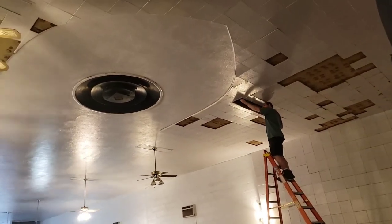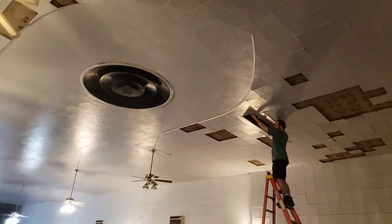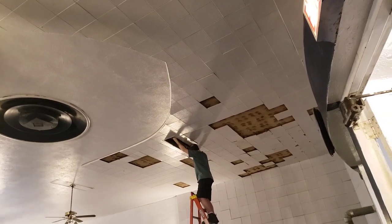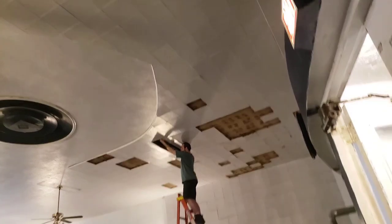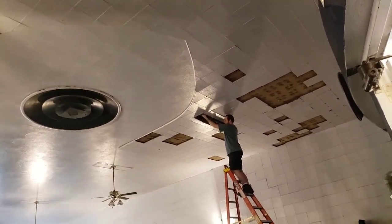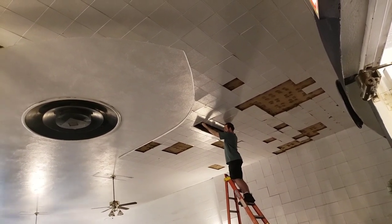But yeah, or if you actually got the bulbs, because those are 40 watters, so you're talking about 160 watts per fixture. I mean, granted, fluorescent watts are more lumens than incandescent watts, but they were putting 100-watt bulbs in these. You're still talking about 300 watts versus 160. I still think the fans is probably more light, plus it's closer to the ground.